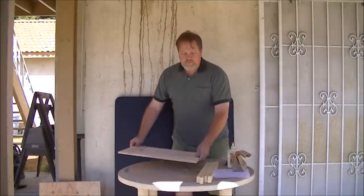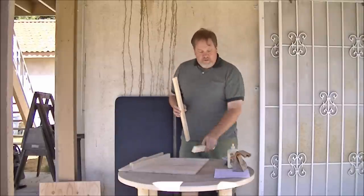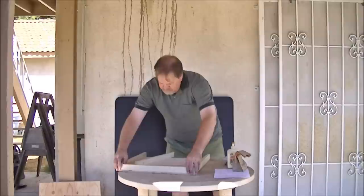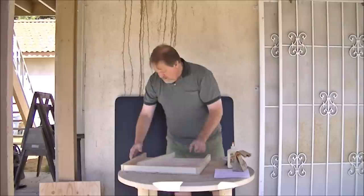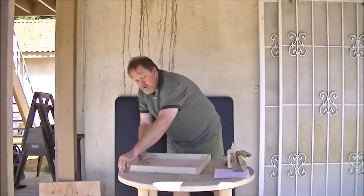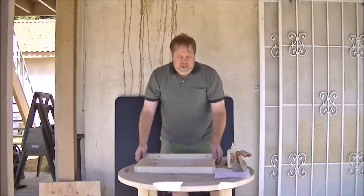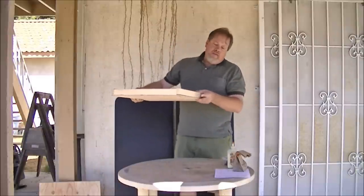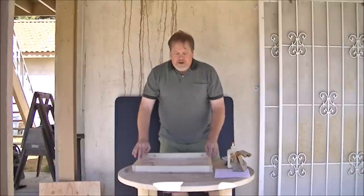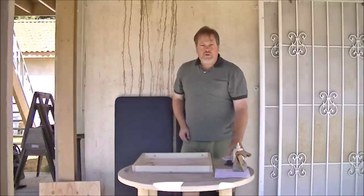Get your boards and make sure you have two of each 20-inch piece — the one-by-two-by-20, finished at one-and-a-half by three-quarter. You want these boards to create a framework underneath. The critical part is that the boards must not stick past the plywood edge — you want the plywood to have a slight overhang. If the boards stick out beyond the plywood, it'll prevent the track from coupling. Once that's laid out, set the framework down, set the top aside, put a thin bit of wood glue down, then drill and screw into the board.